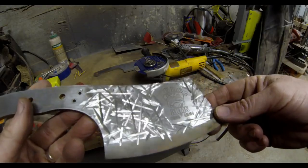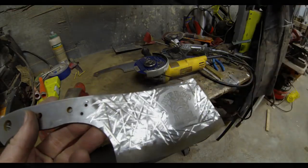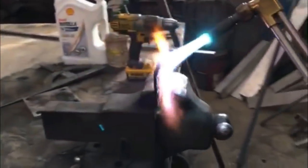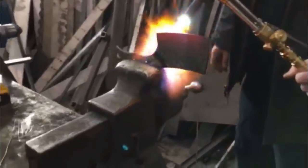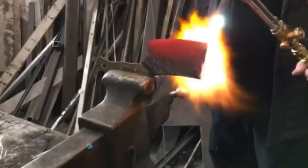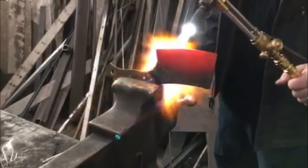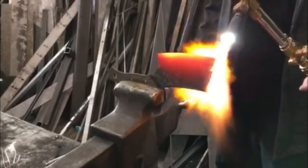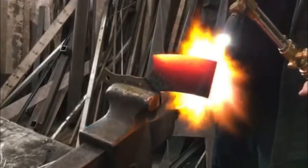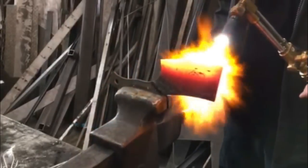The blade is basically finished — it's got all of the blade texture on it and the logo etched onto it. The next step is to bring this over to heat treating. My friend Jason Northgard has a metalworking shop on the north shore and he uses torches, heats the blade up until it is non-magnetic, and then quenches it. The heat and the resulting carbonization of the blade really adds a nice black darkened effect inside each one of those grooves and into each of those lines cut with the angle grinder.